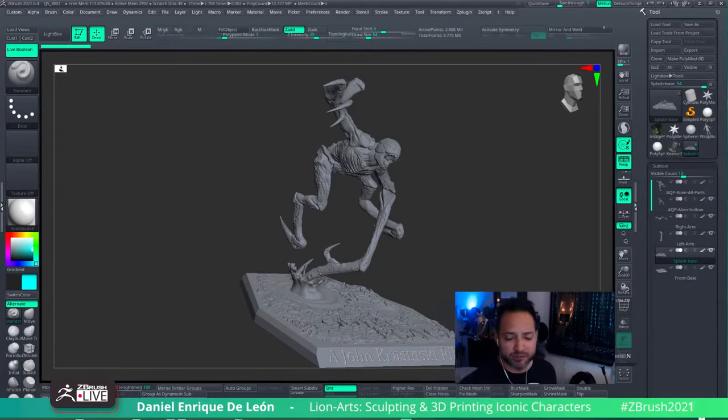So especially with creatures that are all gnarled and detailed like this, you barely see layer lines anyway on a Form 3 because it's such high, beautiful resolution with the laser. Even at its lowest setting on Gray Pro, you won't really see layer lines much because all the details are already in there. I think you slightly see some in the water ripples because I printed those flat. So there are layers going through the water ripples. But they're so concentric and perfect that they just work with the print when I printed it flat against the build platform.